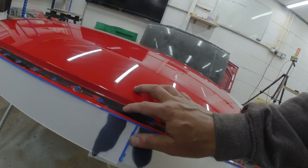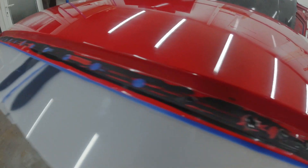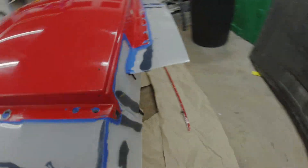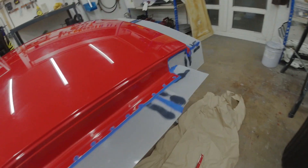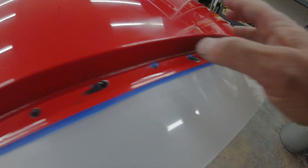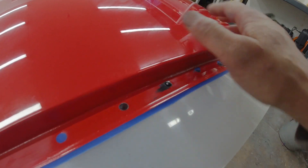All the filleting wax is on now; I've smoothed it out as best as I can. It's got a nice clean edge to it — as clean as you're going to get with cut metal and the way it's been removed from the car. You've just got to do the best you can and work with it. You can see it's all nice and neat, a nice good fillet there. This is all what decides how easy the part's going to release from the mould — you want it to have a nice smooth fillet, no abrupt angles, certainly no 90-degree angles unless you've got a radius on the corner, which I can't do with cut metal. But that's the filleting done.